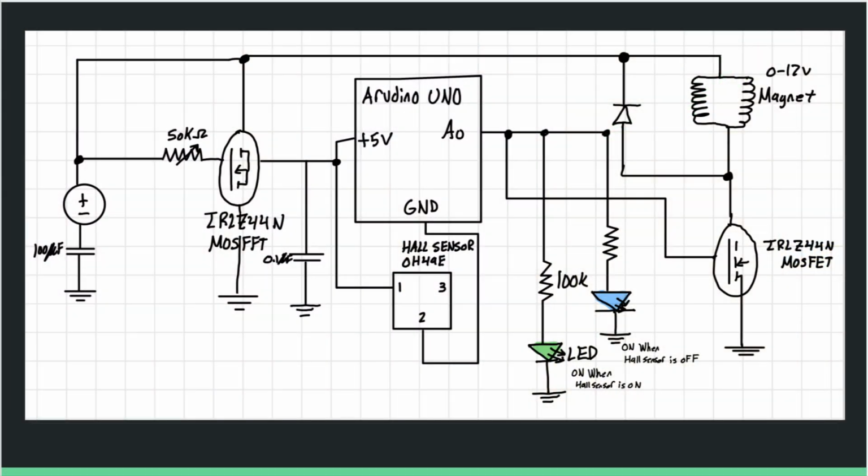Throughout the project, one of our primary challenges revolved around selecting the most optimal sensor for our magnetic levitation system. Initially, we experimented with an ultrasonic sensor, only to realize that its gain and range were far too excessive for our application. Recognizing the need for a more suitable alternative, we then attempted to implement an IR sensor, but encountered the same accuracy and range issues. Ultimately, we found our solution in the form of a Hall sensor. This choice proved to be the most effective as it seamlessly integrated with the code for our PD controller and consistently provided accurate outputs. The Hall sensor's compatibility and precision were instrumental in ensuring the smooth operation of our magnetic levitation system.